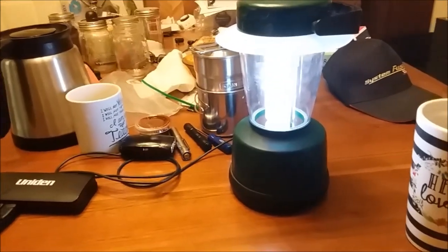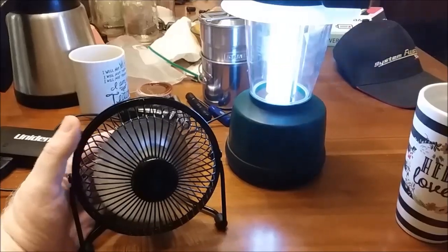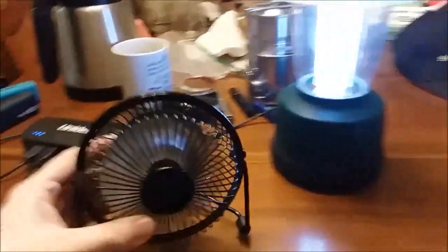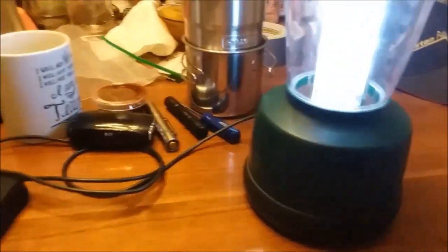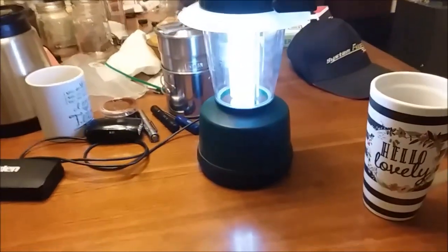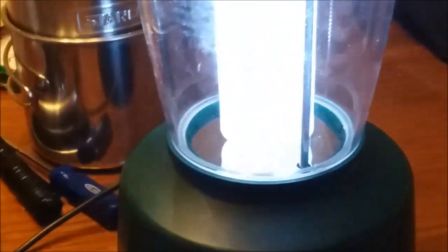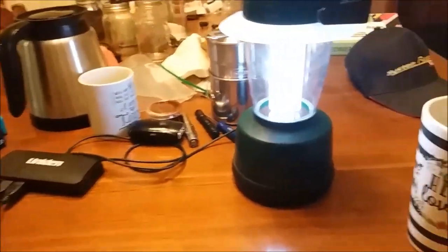I think I was right about this regulating. Let me show you what happens when I turn the fan on — it pulls more power. You can't see it on camera, but that light is actually flickering at a rapid rate now — the power bank is having a hard time. They're popping in and out real fast. It's like a rapid did-did-did. I'm thinking there's a regulator inside — I'm going to try it with a different power bank and see if I've just reached my power limit.